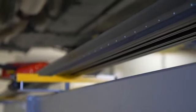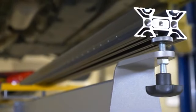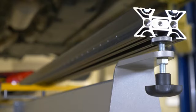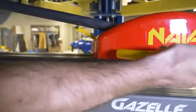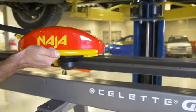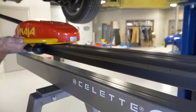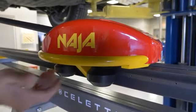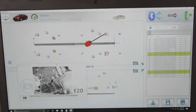That applies to all the different pieces — they all have drivers tied together. The measuring rail is extruded aluminum and pretty rigid, but when you put the weight of the measuring head on it and slide it up and down, there's a certain amount of flex. When we calibrate the machines, that's all taken into consideration — we run the head back and forth over the rail and note exactly its movement. The rail has its own driver file, and the head knows where it is on the rail, so at any given point it knows how much flexion to compensate for in its height measurement.